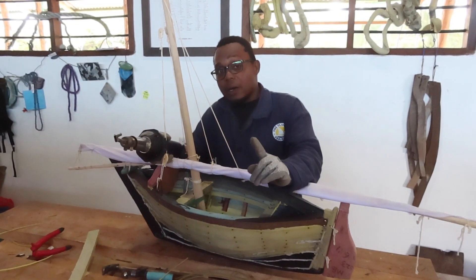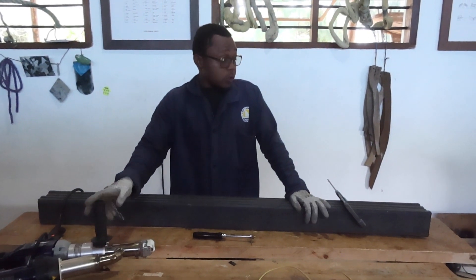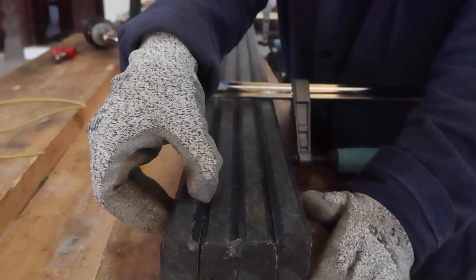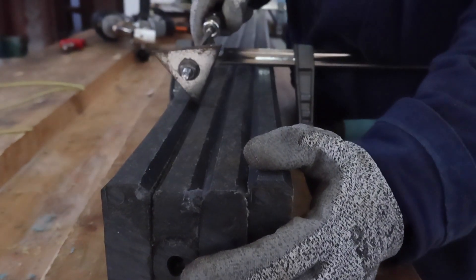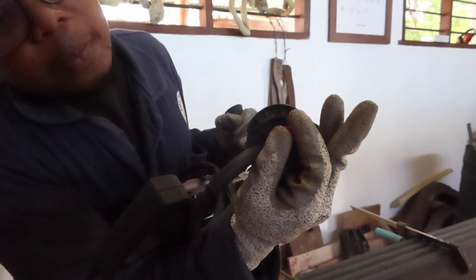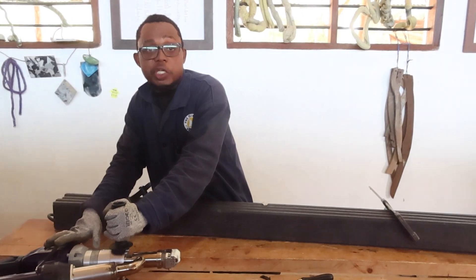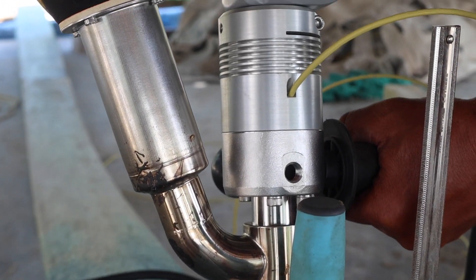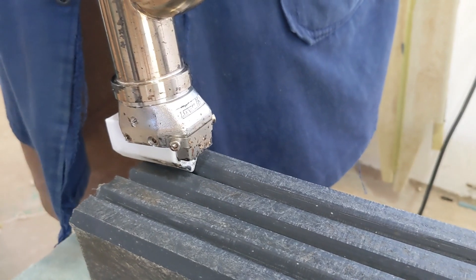Now we are going to look at the big welding gun. I'm going to show you how to use the big welding machine. For this we are joining four planks to make one big piece. We've made some grooves so that the filament can align in the gaps. We will make the final touches with our scraper — we scrape to remove dust or oils. Switch on the machine and rotate the knob up to seven. While we are waiting for the machine to heat, let us prepare our materials. We should have a lot of filament and observe the filament thickness so that it doesn't get stuck in the hole. Now we can weld.